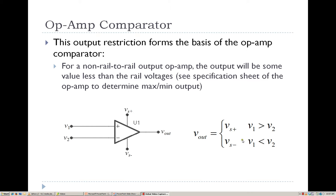In the opposite case, when the voltage at the non-inverting terminal is less than the voltage at the inverting terminal, we'll have a negative potential difference. That negative potential difference will be multiplied by a large gain factor, causing the output to go all the way to the low side of the power supply, so Vout will be the negative supply rail.